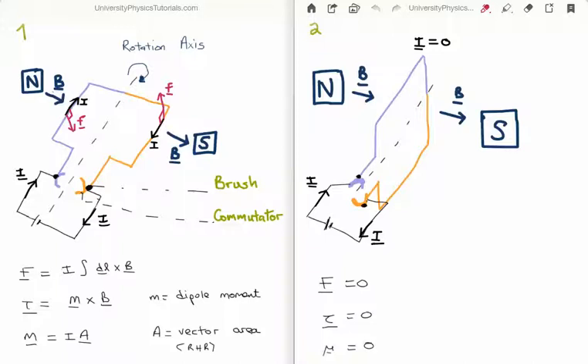Let's say that we have a magnetic field set up by two bar magnets, with a north pole here and a south pole here. We have a permanent applied magnetic field to a current loop, which I've drawn in both orange and purple. I'm going to place a battery, and to the battery I'll attach a wire which comes out and moves to a point illustrated by a black dot on each side. I'm going to call those points brushes.